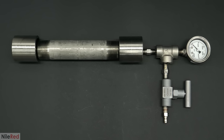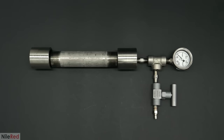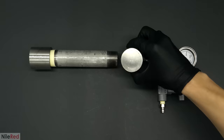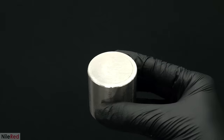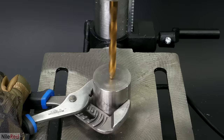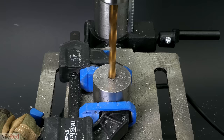At most it would never even get above 1000 PSI, and if it ever even got close to 3000, it would probably mean the entire room was on fire. To put together most of it, I just wrapped each of the threaded pieces with Teflon tape and screwed them in. The only tricky part was the last end cap piece, which had no place for me to screw into. So to attach the pipe to the rest of the setup, I had to make a threaded hole myself. I started by drilling a small pilot hole, then replaced the small drill bit with a bigger one and kept on drilling. After taking out a small amount of metal, I added some soapy water to help keep things cool.